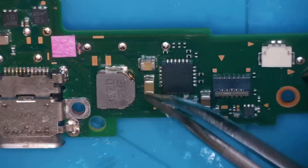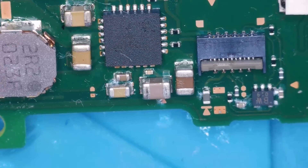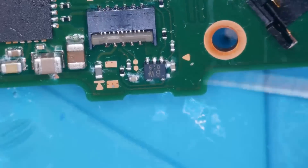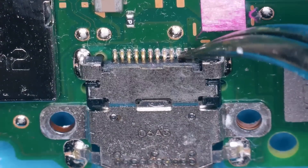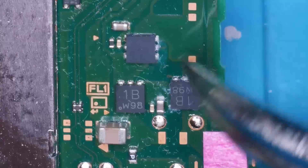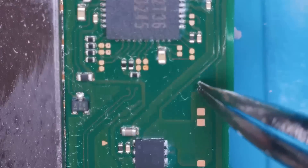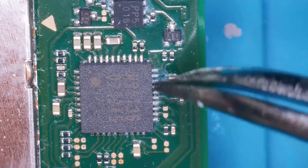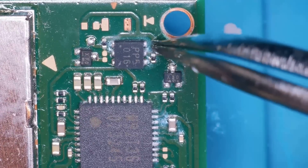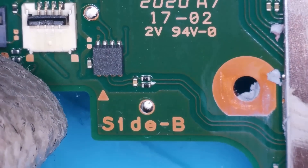Under the scope, we have quite a bit of corrosion — not around the BQ chip as such, but just below it on these caps here. You can see corrosion around the capacitors near this chip. The actual port itself shows corrosion in between the pins as well. There's also some corrosion around these little chips nearby. As for M92, it's been hit — M92 has seen better days. The good thing is, this still looks like early signs of water damage. I don't know if I'll be able to fix this, but I'm going to try.